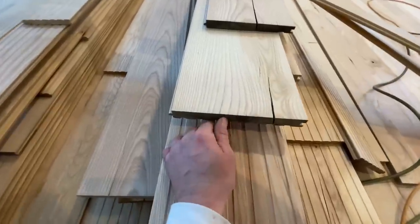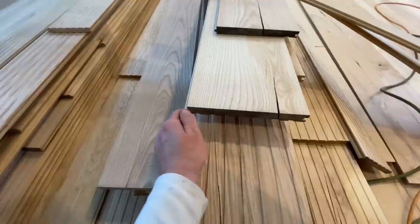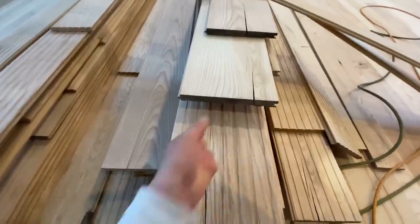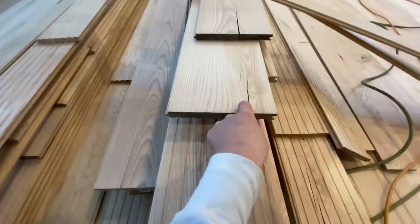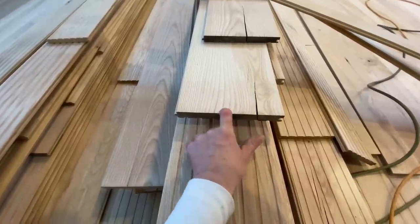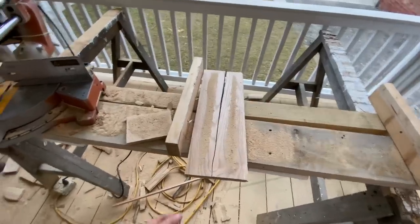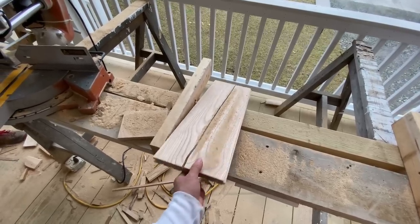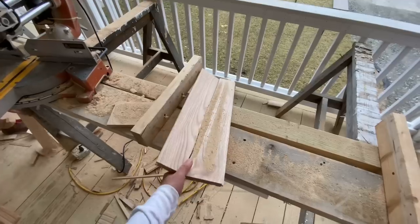These boards are not end-matched - meaning they don't have a tongue and groove that goes across the end of the board, like typical mass-produced manufactured hardwood flooring. So that's another reason we're going to put face nails in the ends of the boards - to prevent the ends from one cupping and the other staying flat, causing a little catch. Seriously, I'm not throwing away anything - even this cracked board I will cut some straight edges on and nail it down in a closet. The reason we cut this so close on material is I bought it about five years ago having no idea it might be approximately the right amount to do this house. It just happened to look pretty close, so I had it milled, and now we're going to find out how far we can go with it.